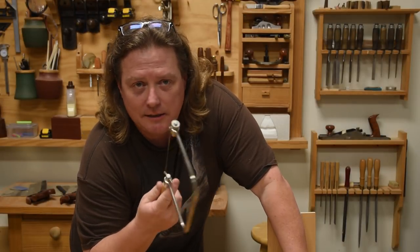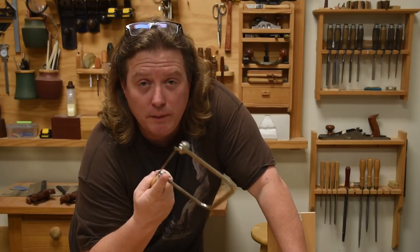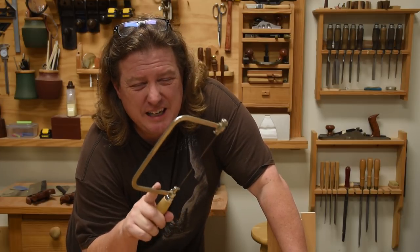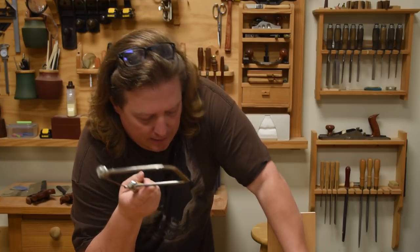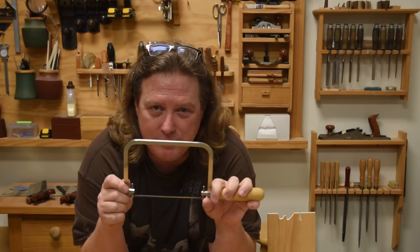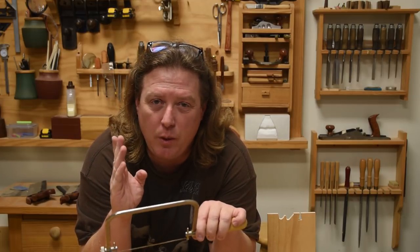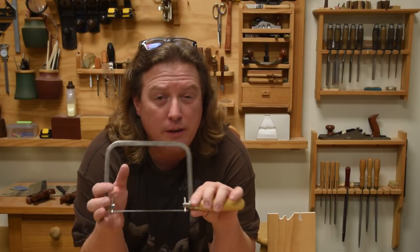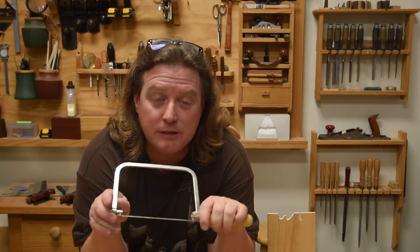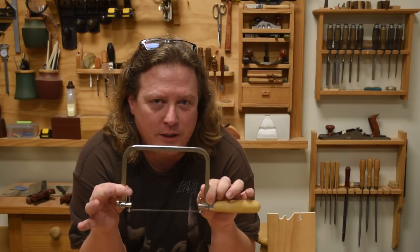I've gotten a lot of coping saws over the years — a lot of times because I give them away to students, and kids really enjoy using them because they can cut curves, cut letters out, that kind of stuff. The one I have right now is probably the best value. It's an Olsen one. Olsen also makes blades, which are pretty good — I want to say they're $10 or $12, which is dirt cheap for a woodworking tool of any real use. The big problem, as I expressed earlier, is the ability for the frame to flex. There are coping saws out there that use a truss frame — a really cool setup that pretty much takes away all ability for the blade to flex, so you can put a lot of tension on those. So much so that you can snap the blade just putting tension on it, especially with those really tiny fretsaw blades. If you're really going to be using this tool a lot beyond just removing dovetail waste, you might want to investigate them.